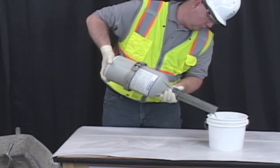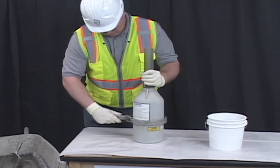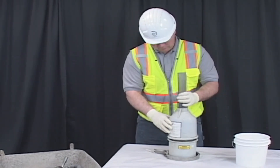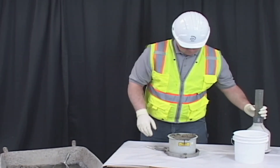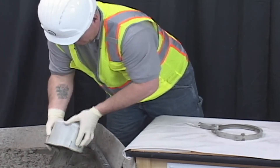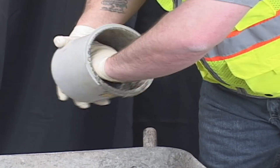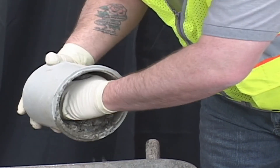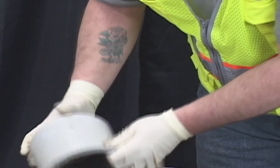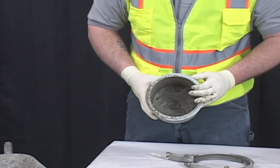Before disassembling the base, pour out the liquid. Remove the clamp and remove the lid. Discard the contents. Examine the base for portions of undisturbed, tightly packed concrete — if such material is present, the test is invalid. The air content is equal to the final meter reading minus the correction for large amounts of alcohol, plus the number of calibrated cups of water added. Report the air content to the nearest 0.25%.